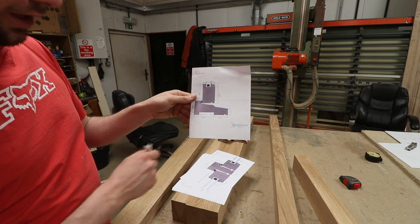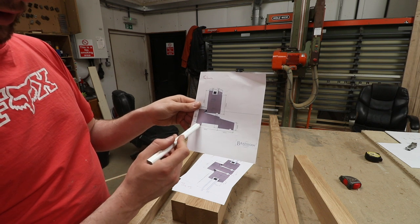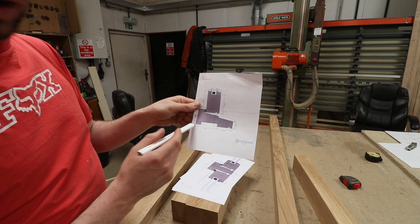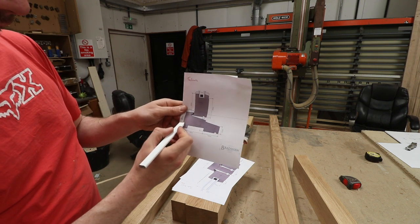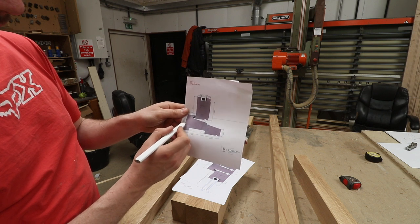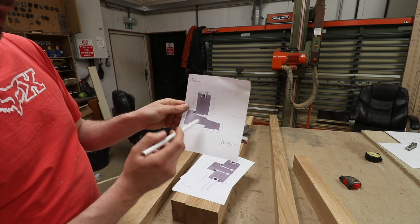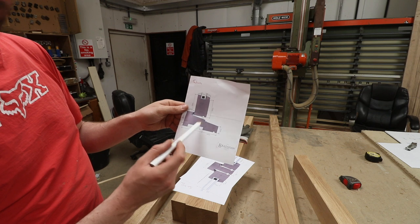So on this particular sill, that's not an awful lot of timber because half an inch of that is the extra strip. So we've got about half an inch on that back edge of the timber. So we've got a bit of scope there to hide something on the corner for up to half an inch. We've got a load to rebate out the front, and we don't see much of that bottom corner, so we can hide some imperfections there.